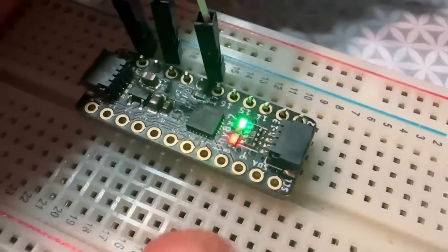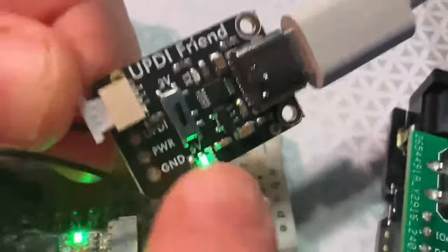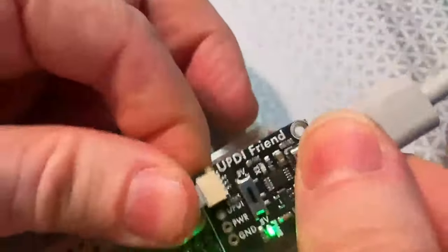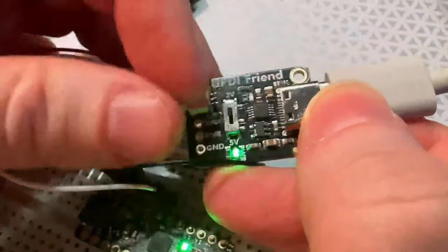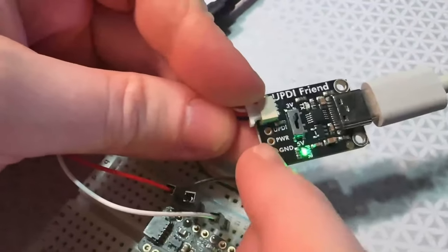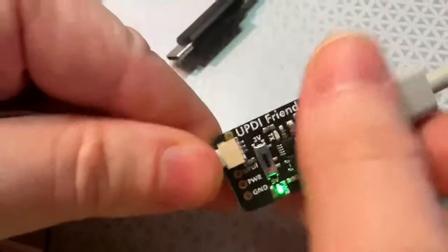Lydian, what's this? This is an ATtiny817 breakout board, which we stock, and this is my UPDI Friend. UPDI is a one-wire programming interface for modern ATtiny chips — it's nice because you only need one wire, it's compact, and you just need a USB serial converter. I designed this board with a three or five volt logic and power selection switch, with power, UPDI, and ground connections and silkscreen on the back. You can use a JST-SH cable to make wiring nice and easy.